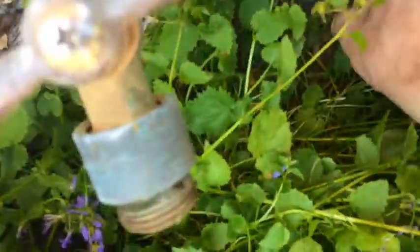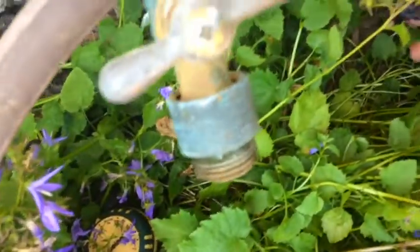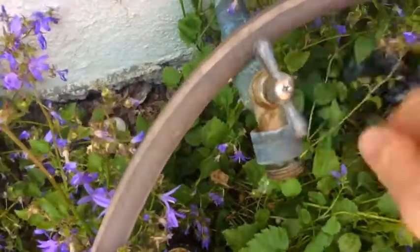Now outside to turn the water on. The water is going to come back on. I've got the hose bibs open still, so when the water comes on, the air that's in the line can be pushed out through there. Open it all the way too so that the valve seats up against its full opening. Turn this off, turn this off. Run over here — get this one off. And now inside the house, the valves are open.